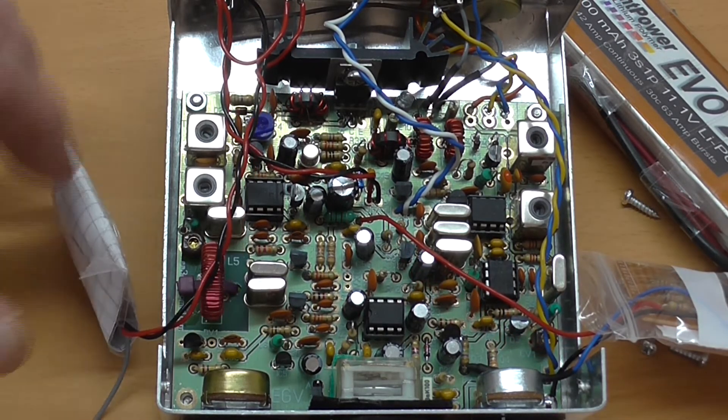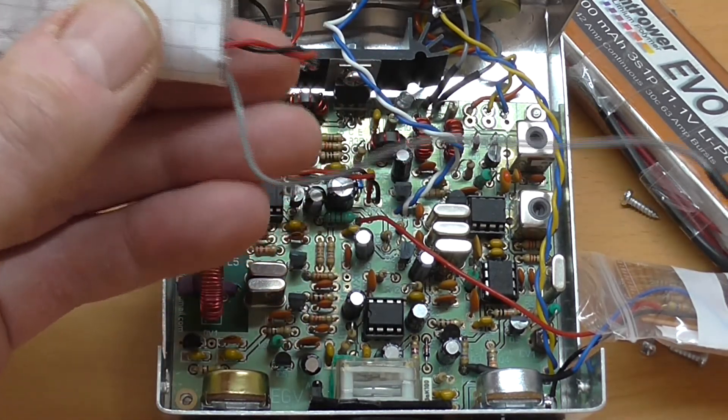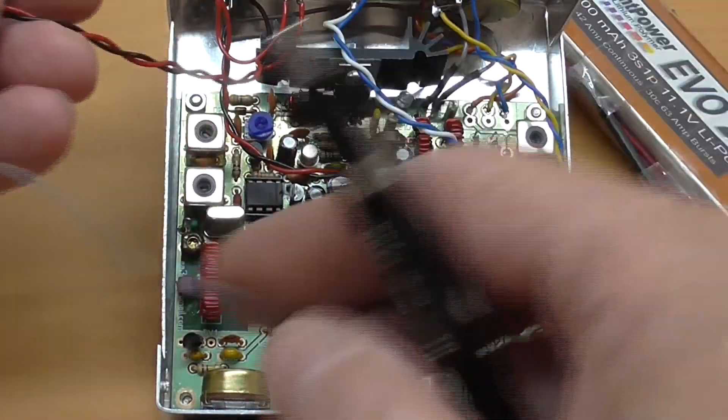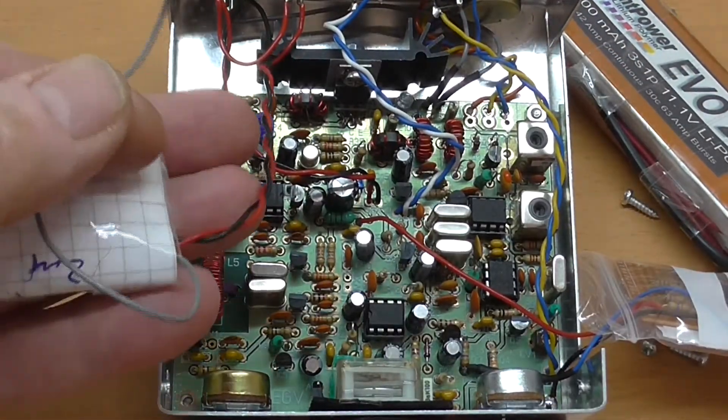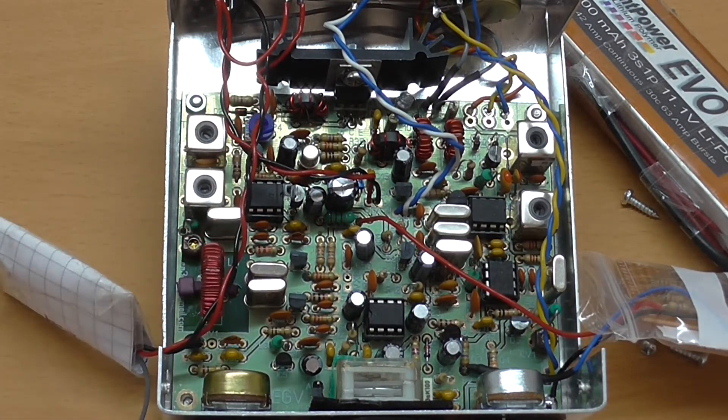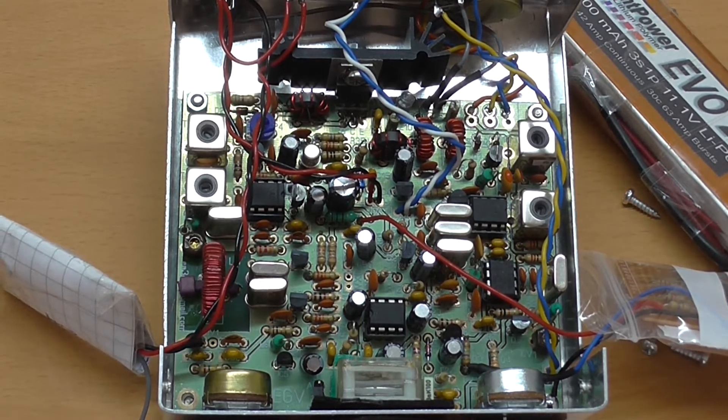This is the little 7030 spotting oscillator, which I've built onto a piece of perfboard. The length of wire here acts as an antenna, which radiates a couple of milliwatts inside the housing when the button is pressed. I think now we'll put the lid back on and hook up an aerial to have a look around the band.